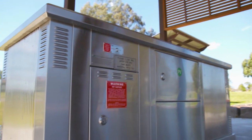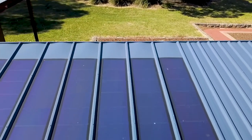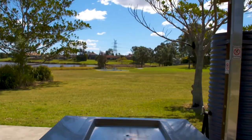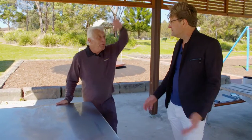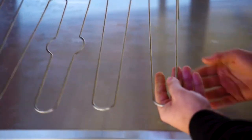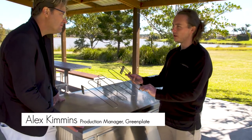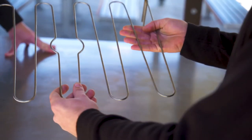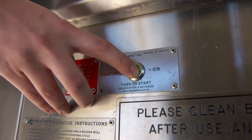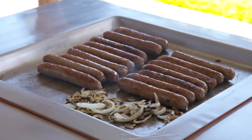We looked at electric barbecues and how much power they actually used — it was horrendous, impossible to do with solar. So we totally redesigned the plate using battery voltages instead of mains power. It would cost in the vicinity of $150,000 just to run power here, so the installation of this is a fraction of the cost. This is the barbecue heating element. The key difference is that we use a continuous piece of nickel chrome wire, which means we do not have to insulate the element — like your toaster, it turns on immediately and gets red hot. Let loose, it'll run at over 400 degrees centigrade, but I've cut that back to 320, otherwise we'd be charring people's food and sausages for sure.